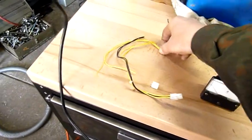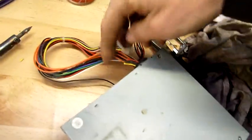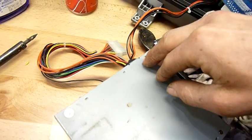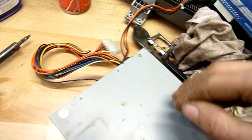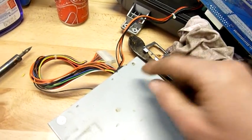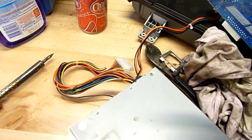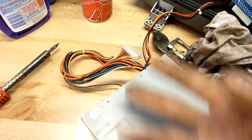So I can't just desolder all these connectors from the power supply internally like I could on this one. All the yellow wires terminate on the one 12 volt rail, all the red ones are all 5 volt rail, and I could just as easily run thick cables out here and combine them all through amp meters and monitor total 12 volt and total 5 volt loads.